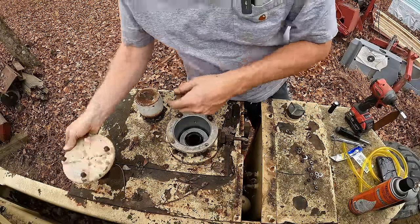This is our swing. But see, all these switches up here, these levers, they have this pull thing, so you'd have to pull this collar to let the lever go back and forth. But they're all stuck, and I've been soaking them down with penetrating oil for quite a while, but you can see, like, this one here, it's got like a plastic liner that's rusted and blown apart on it, so I don't know if we're going to be able to get any of these to work, but this one here is free. So, yeah. We're going to try a little bit of everything here.